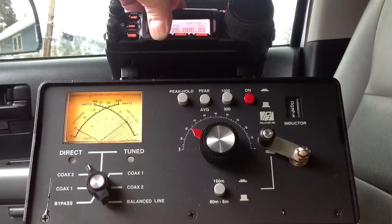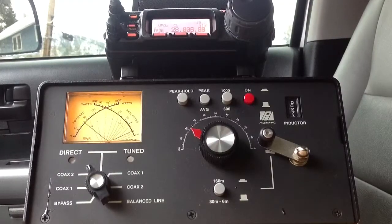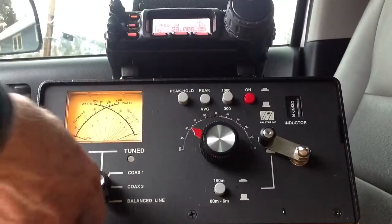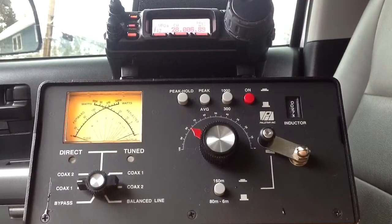The sleeve on that ATAS was about eight inches above the base on 10 megahertz — it'll go down to within an inch or so on this band. It's down to about two inches. There we go — it's down to about an inch and a half, maybe two inches. Now I can't imagine how this ATAS is going to outperform my whip on this band because this whip on this band is one-quarter wavelength, naturally resonant. S6, S7 noise on the ATAS; S7, S8 on the whip.